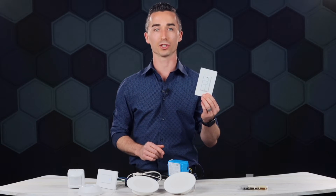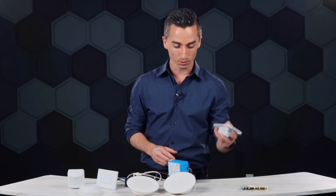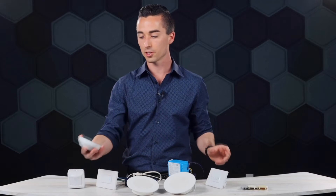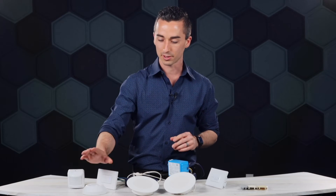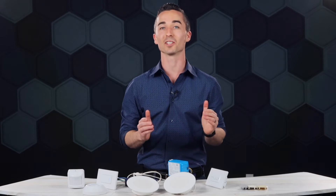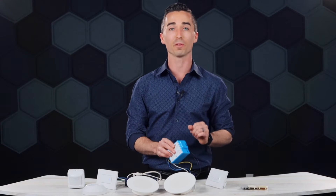Then I go to my wireless wall station and I hold the pairing button for the wireless wall station as well. Now, I want to add my occupancy sensor too, so I'm going to my occupancy sensor. There's a single button here to pair this sensor — I'll hold it. Done deal. My sensor is also programmed to this power pack. The last step is to take this power pack out of pairing mode — press the button once, and it's now out of pairing mode.